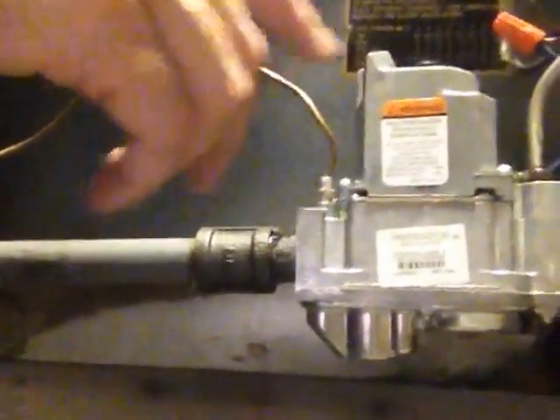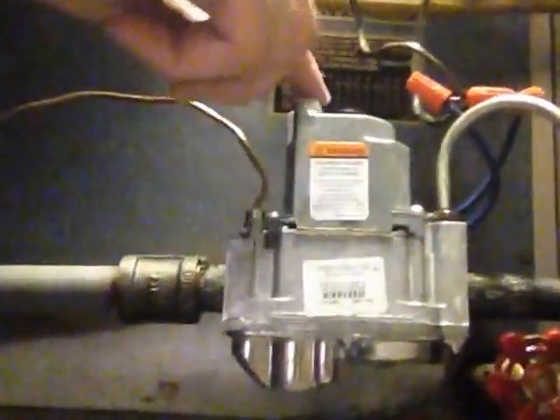Don't use tools. Don't force anything. If I smell gas — which I don't because it's already off — remove the pilot access panel located under the gas control unit, which I believe is that fellow right there. That whole thing just comes right off. Each side of this has a... don't hit any of these fragile copper lines as you're coming out. This right here is the thermocouple, I think. And this is the regulator — this is going to be what I have to turn to pilot when I'm ready to light it, which I'm not just yet.